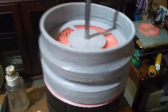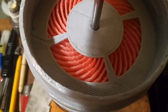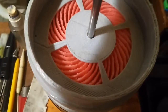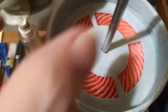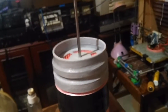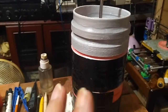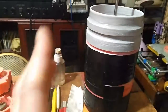Right, it's interesting the way I turn it with my fingers. I haven't got it lined up yet. I'm just letting it dry a bit, because it sticks a bit if I don't let it dry a bit. It's drying basically in a sandwich, so it keeps it straight. It is dry-ish. I just don't want it to warp on me. And the best way to dry it out, I found, is to leave it in situ in the tubes, because when you get a draft, with the acetone in the plastic, a cold side where the wind draft is blowing across it, it tends to curl on that side.